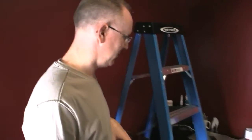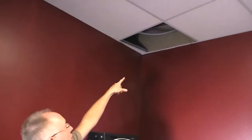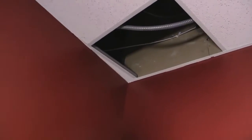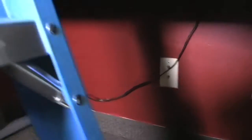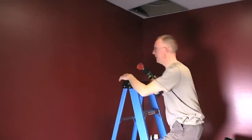Alright, so we're back here in my little corner of the office. What we're gonna do is — you see I pulled a ceiling panel out back there. Up there in the sheetrock, that wall is where I want the Ethernet, but I want it down here. If you look down there, you see there's some phone jacks but there's no Ethernet. So we're gonna put an Ethernet jack on the wall here, but in order to do it, I've got to run the Ethernet up through the ceiling tiles and into that wall and then drop it down.